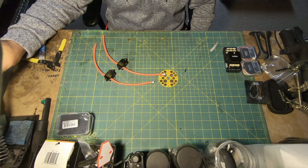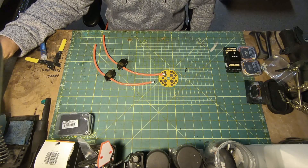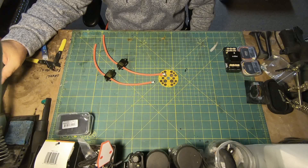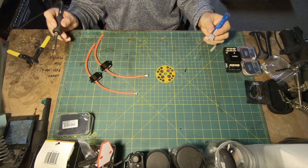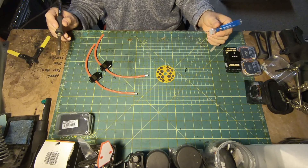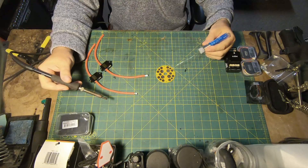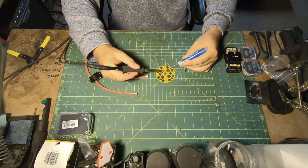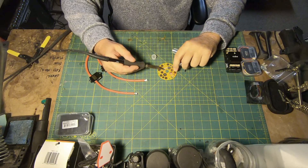Don't be shy about exposing some wire. If you're new to this, don't get a Radio Shack soldering iron — you want to get a quality iron like a Weller. I have a Weller WES-51, which is around a hundred dollars, but it's well worth it if you're going to be doing a lot of this. I've got your basic Ace Hardware fine electrical rosin core solder. It also has a flux core, which helps make a nice alloy bond and over time prevents corrosion. Most fine electrical solders are like this and recommended for this type of work. I'm going to apply a large base of solder — be liberal with it and get yourself a nice big dab.